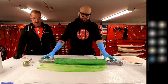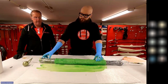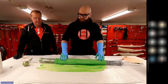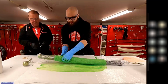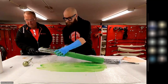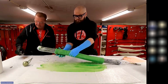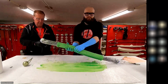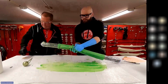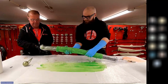So you need some space here where the packer is not inflating, so that's why it's a safe measurement, but that's in the fact sheet or in the manual, so it's easy to check out. Yeah, it's definitely in the manual, and it does differ a little bit by the packer, so it's good to know and note that. And now we are adding the rubber strings or the rubber bands just to hold this patch piece onto the packer.